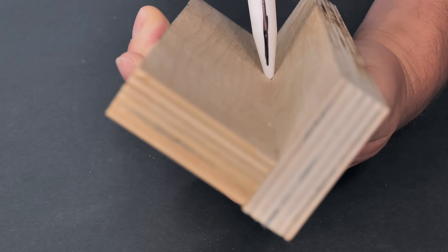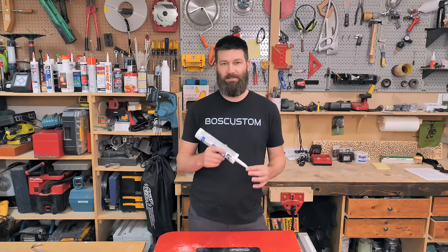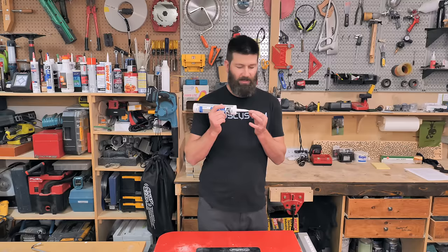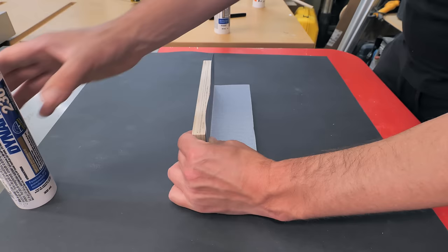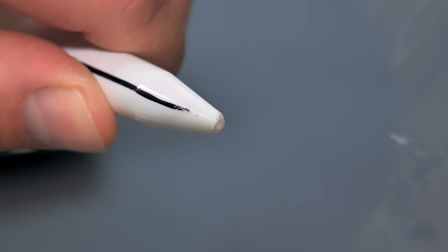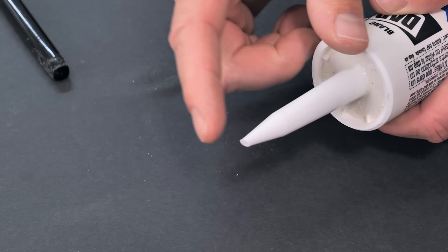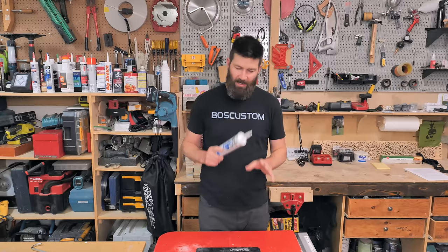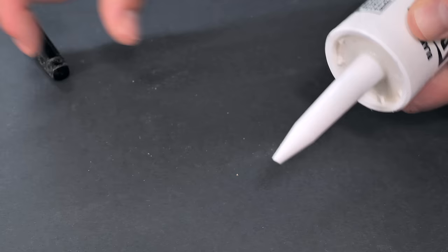Get the tip as small as possible on a bit of an angle. Then I like to get a little groove on the tip so it rides nicer and holds where it needs to be. You may have noticed that after caulking half or three-quarters of a tube, it starts gliding perfectly — I like to put that little groove in right at the start. Take two sanding blocks or a piece of sandpaper, make a 90-degree angle, hold the tube the way you'll orientate it when applying, and just swipe it back three or four times to wear in that groove. Finally, I like an orientation line right on the very top, in line with the longest point of the tip — as you navigate the tube around, that line helps you keep it orientated in exactly the right position. A felt pen line will make a world of difference.